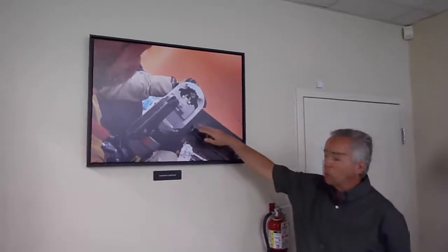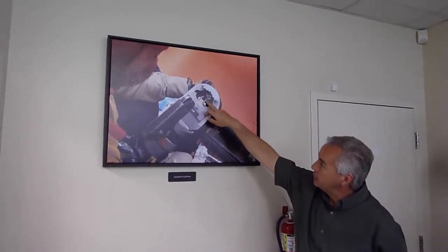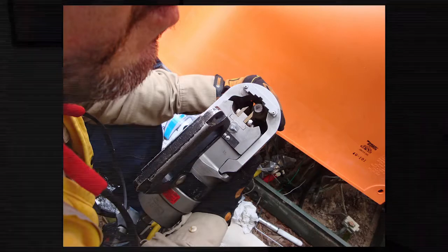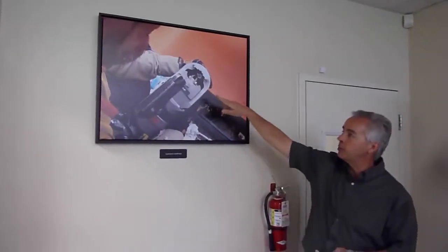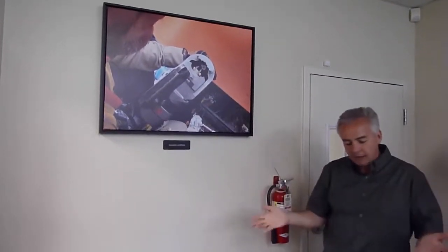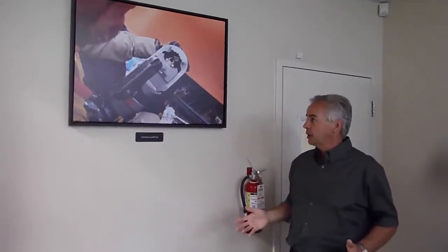So I think Norm did most of the design work on this, and if you look at these blades and you have this connector, a lot of times when the cable comes out of the ground, there's no slack in the cable at all. And it comes up and it lands, and it's supposed to plug into a certain point on the equipment. If you cut off just 1 inch of cable, you wouldn't be able to get it back into place. So we have to be very careful. We cut off the connector without cutting the cable, and then this tool cuts into it like that, and it falls off very easy, and you lose no conductor at all. So you don't even lose a 1/2 inch of conductor.